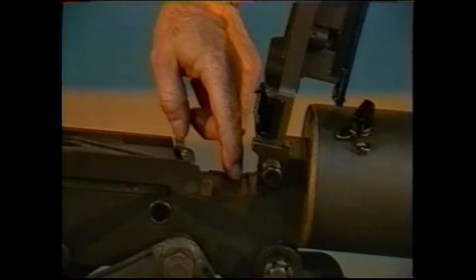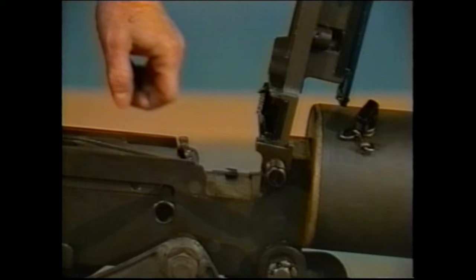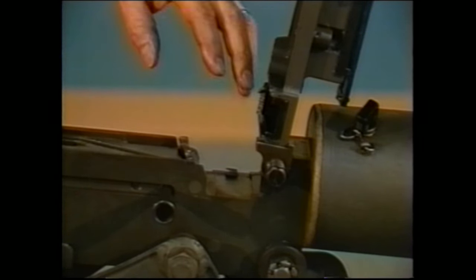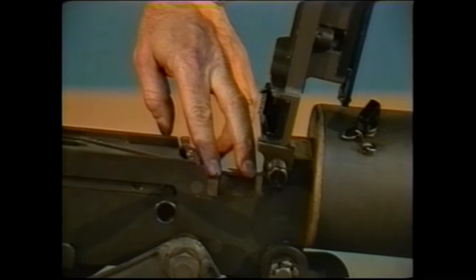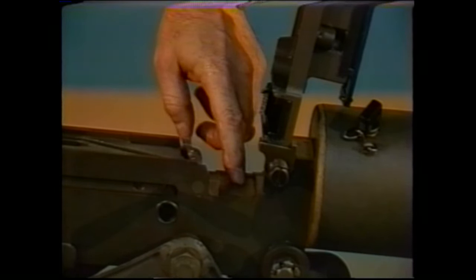If you do abrade it sufficiently, you will either have to repair it by welding, or you will wind up getting feed failures and other malfunctions. The gun was designed long before the metal links were designed. That's the reason for the defect. In general, you can use the cloth belts on any of the guns. The steel-linked belts should be restricted to those guns that have steel trunnions.